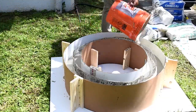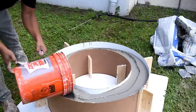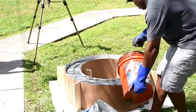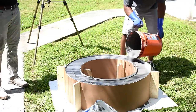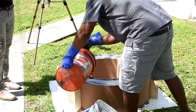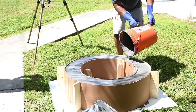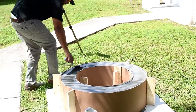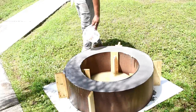The form was 36 inches wide by 12 inches high with an 8-inch thick wall. I wanted to add a dark line going around the bottom of the fire pit, but because we were moving so fast I almost forgot to add the pigment. On top of that I forgot to shake the bottom, so the color didn't come out as dark as I liked, and by the time I poured all the mix out I realized there was still pigment left in the bottom. This didn't make or break the design — I just missed an opportunity to get something I wanted.